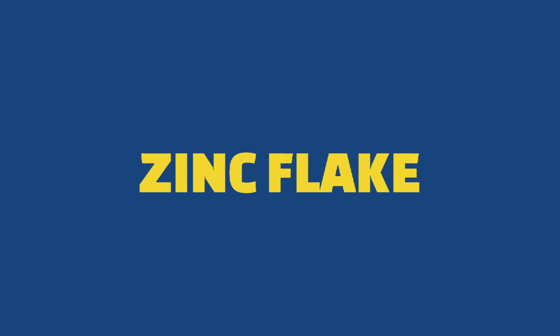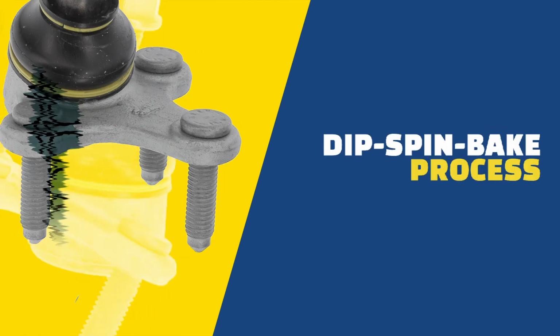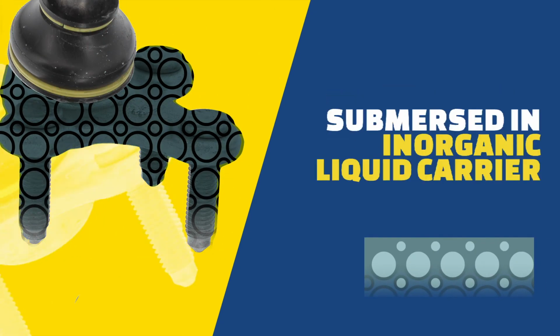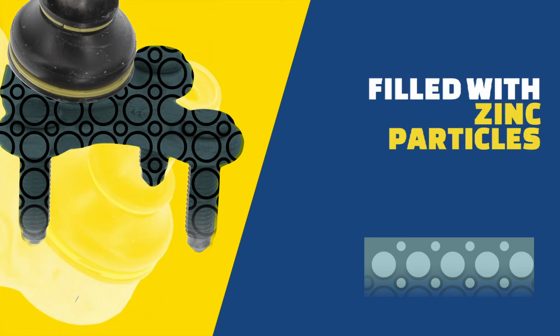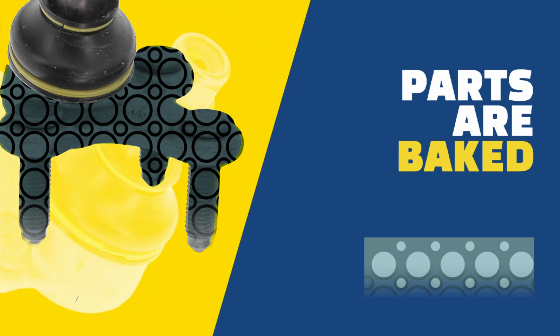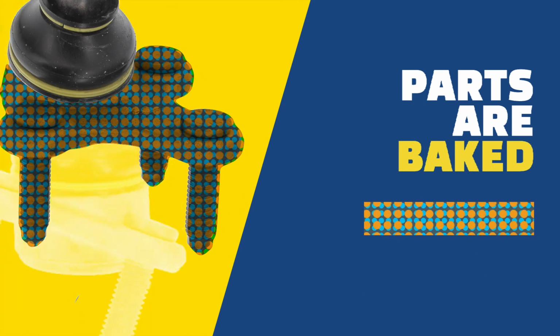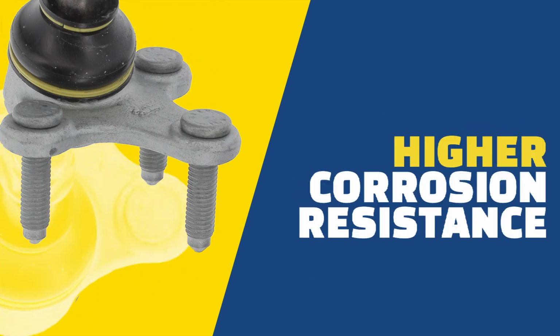MOOG's bolt-on ball joints and accessories have zinc flake coatings. These coatings are deposited by a so-called dip spin bake process. The housing of the ball joint is submerged in a very thin inorganic liquid carrier filled with very small zinc particles. This paint-like substance covers the products, and spinning is needed to remove the excess liquid afterwards. Subsequently, the parts are baked in an oven. This creates a solid layer filled with zinc and aluminum flakes stacked upon each other and results in the most durable corrosion resistance.